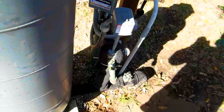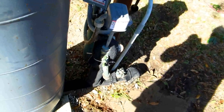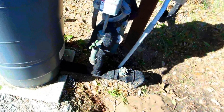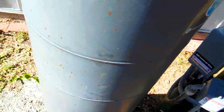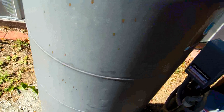If you're using the well a lot — watering the grass — you want to use like three hoses to keep the well running constant. It's the fact that it kicks off and on repeatedly that causes problems. If this bladder breaks or something, that will be a problem. By maintaining this bladder, it can last 30 years.